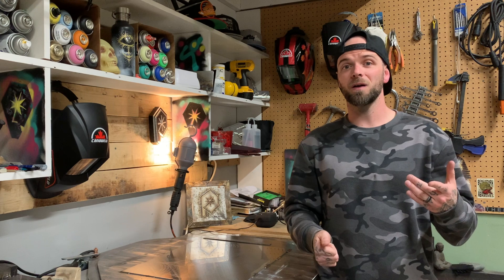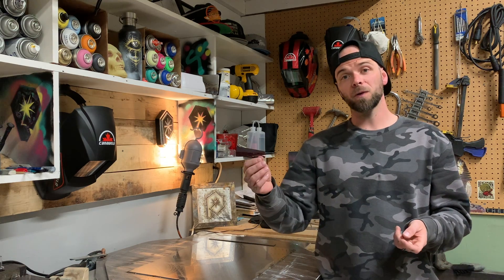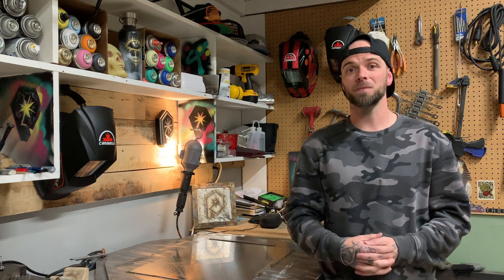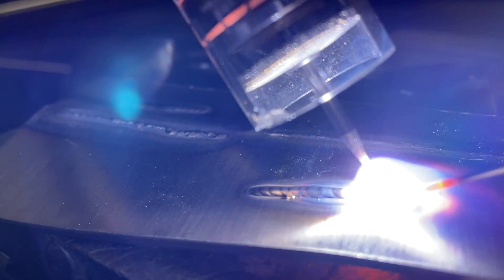In this clip, you can see me running along and everything's breaking off nice and cleanly. This is a slow motion clip, so you can actually see the filler rod goes over the edge of the puddle slightly, but not underneath the tungsten — this is going to be somewhere in the ballpark of your sweet spot. If you have a proper filler rod angle, proper torch angle, and your filler rod is going in on that sweet spot of the weld pool, you're not going to have problems with your filler rod sticking to the workpiece.